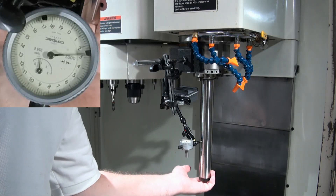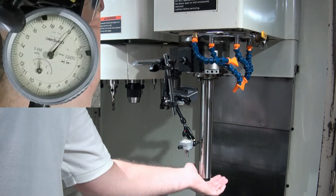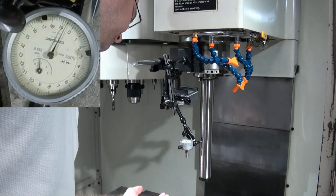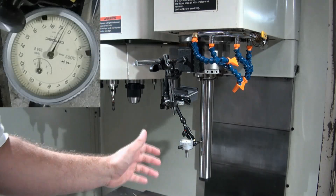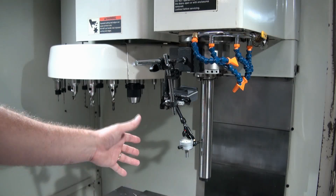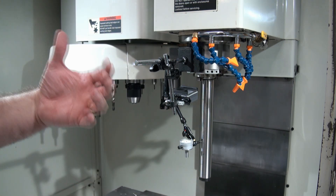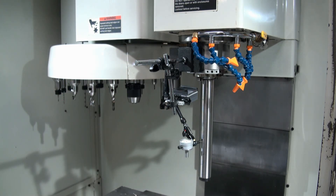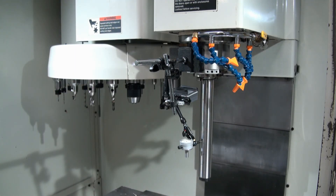Your spindle bearings are supposed to be preloaded — and preloaded pretty high — so that you have rigidity in your spindle. If you see more than a tenth or two of movement, that means your preload is starting to drop. So let's run this test. I'm going to pull towards me first — you don't have to force it, just deflect it a thou or two — and let go. We're at zero. Now I'm going to push and let go, and now we've got about 0.006 millimeters — that's about two ten-thousandths, but that's only at eight inches. This spindle is right on the edge of what we'd consider acceptable. The preload on the bearings is probably starting to drop a little bit.